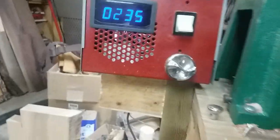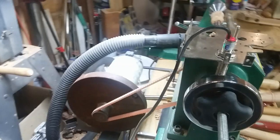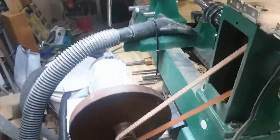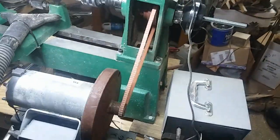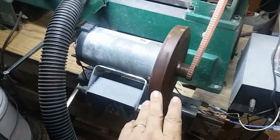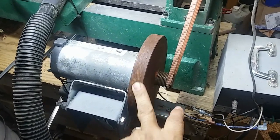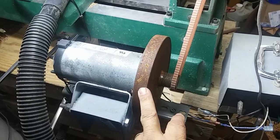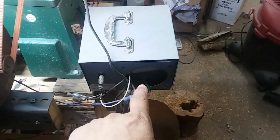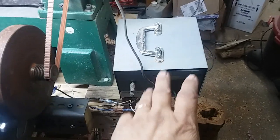Now I'll show you how I did it. Basically what I did was I took a DC motor out of a treadmill. I got the treadmill out of the dump — didn't cost me anything. I got the motor, and then in this box I have the motor controller board, and there's a choke in there that helps to smooth out the signal.